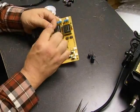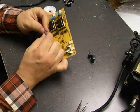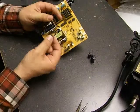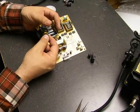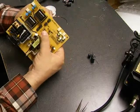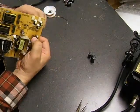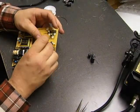On the capacitors, one side will have a gray stripe and a negative sign — that is the negative terminal of the capacitor. On the board, the negative side is going to be shaded. The positive side sometimes has a positive mark. You can also tell by the length of the leads: the longer lead is the positive side, the short lead is the negative side. You do need to make sure that you put them in with the correct polarity, because if you don't, as soon as you power it up it will blow the capacitors out and you'll have to start back over.